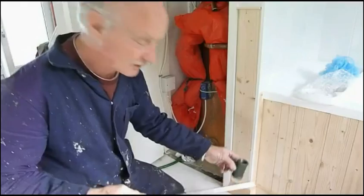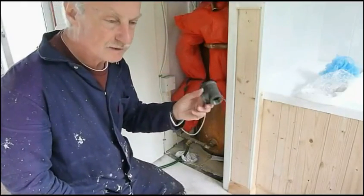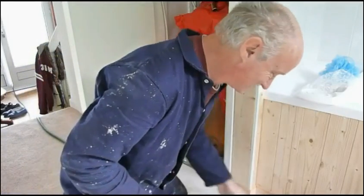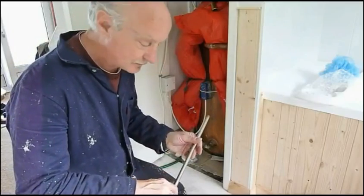You've got plenty of room in that fitting to allow the pressure through — that's why we're going to use this. I don't really like to use an inch barrel fitting but it's the only thing that's going to fit there, so I'm going to use a brass nipple in between to stop the metals from reacting.